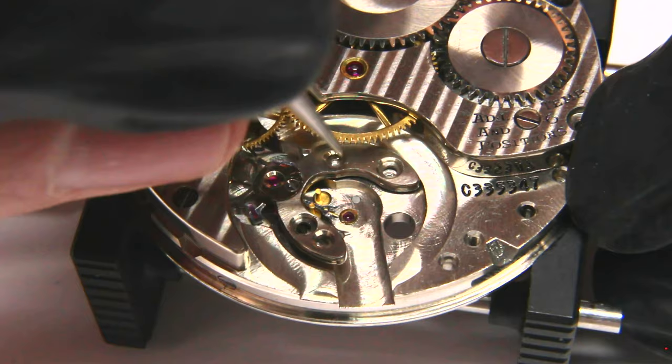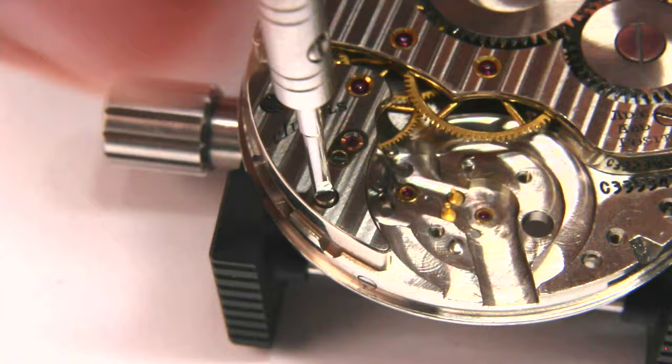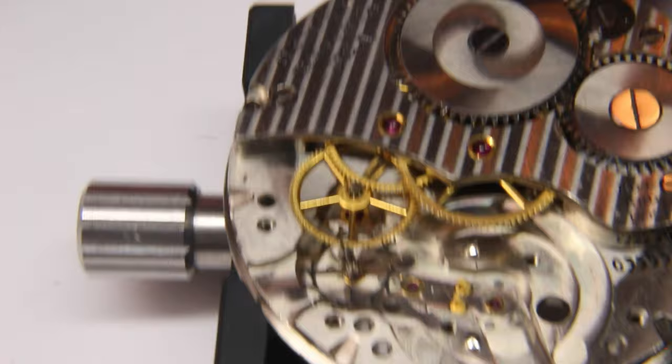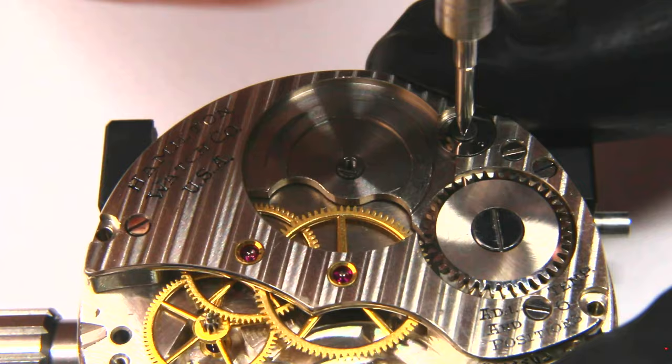For those just starting out with this hobby, 16-sized pocket watches are the best platform to learn on because of their modular plate design. However, most tend to gravitate toward the 18-sized full plate movements, thinking the larger size would be less intimidating. But trying to align all the pivots as you lower the single plate is an unreasonable expectation to set for yourself as a beginner. Most 16-sized American pocket watches share the same high-level design as this one, so don't think you need to drop hundreds on a railroad-grade version either.